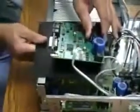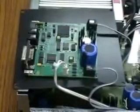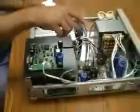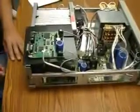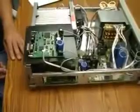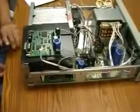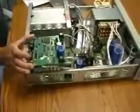To ensure that there's no short or safety issue to whoever is doing this test, an insulator of some kind, in this case I used a piece of plastic, should be used on the top of the instrument, so there's an isolation between that and the chassis. Then what you would do is connect your connector to your computer, turn your instrument on, and do your testing using your automatic computer program, and that computer program can also be found in our service manual. When the test is complete, turn the power supply off, unplug the instrument, and reconnect the cables as shown.